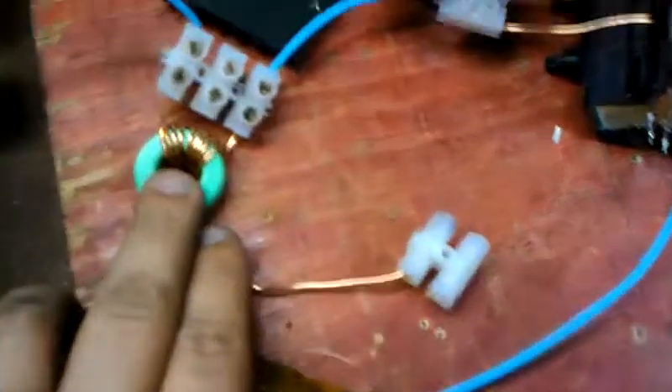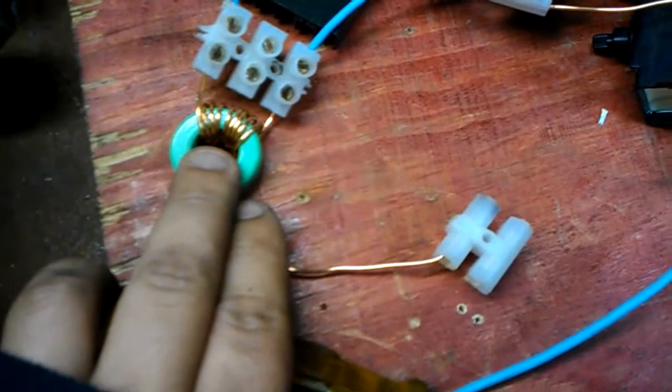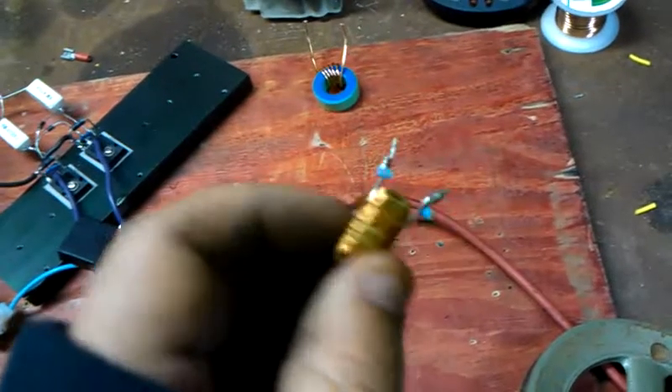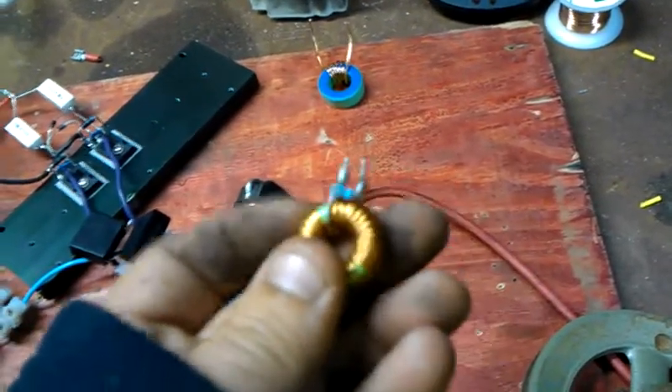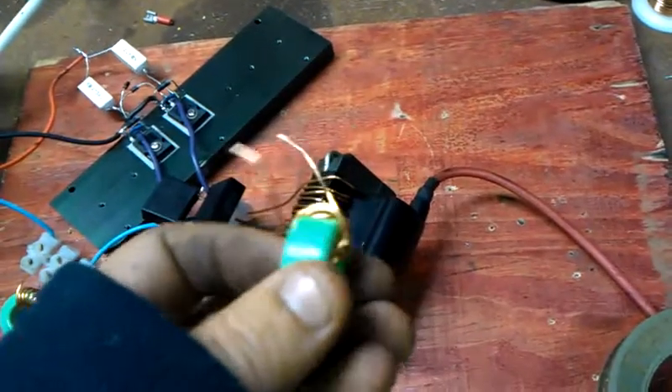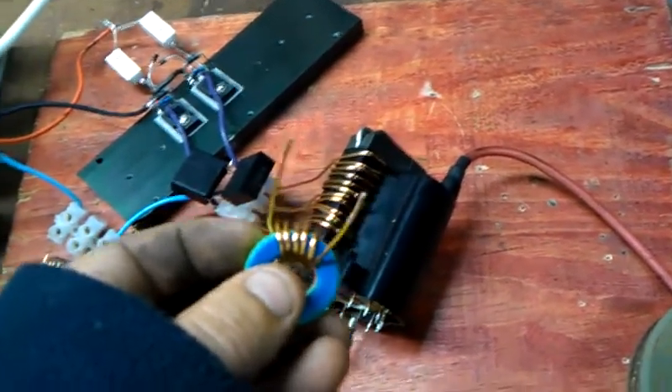Something I've found is that a lot of people have been telling me that my inductor is wrong — not enough turns. But I've got eight turns on there. Now if I try with this store-bought 100 micro-Henry inductor, that one worked fine in the Royer oscillator but doesn't work at all with the ZVS — it just will not start oscillating. I also tried it with a few less coils and actually got less output that way. So with eight turns I seem to have found the sweet spot for my ZVS.